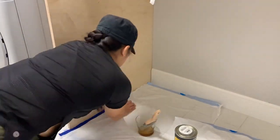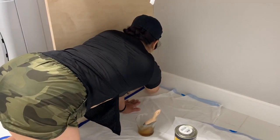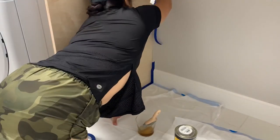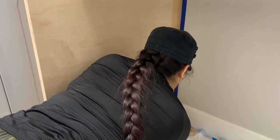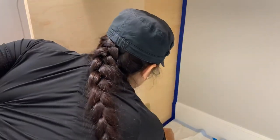I was really impatient at this point. I had stained part of the counter but not all of it, so I had to stain some pieces while they were already in place. I just wanted my laundry room to be done. It was still one coat per day, waiting overnight between coats, so it took a while to achieve that light wood tone color I really wanted.